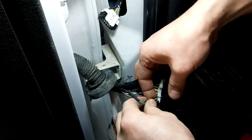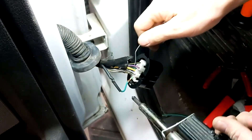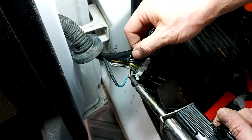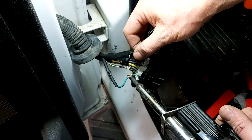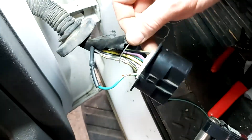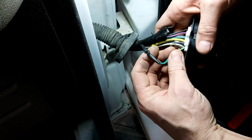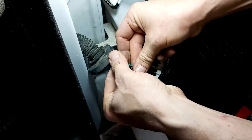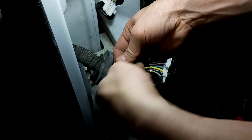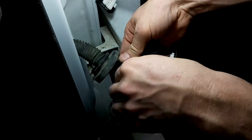We'll have a better connection. The wire's not gonna be too terribly long, so it won't break again. That looks good. Solder flows from the opposite side of where you're heating — let it flow in. There you go, get a nice gray finish on there. That looks real good. Nine times out of ten you're gonna forget the heat shrink — oh man, it's not the right shade of green. We can fix that in editing, make the colors look the same.